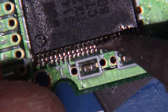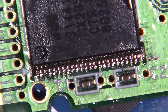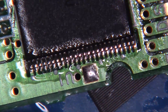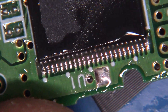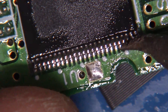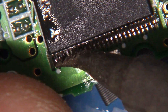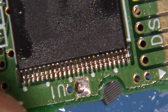I have a feeling that maybe the problem is in fact cycle wear. What is cycle wear? That's where we are cycling video game cartridges in and out, in and out, in and out. And unlike older Nintendo games which use PTH technology — plated through-hole technology — these are surface mount parts. These PCB substrates are really, really thin. They flex. The solder can fatigue, and these joints can go open, meaning the signals go open. So let's go ahead and do it.